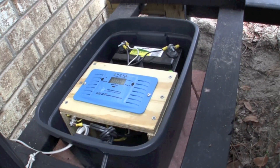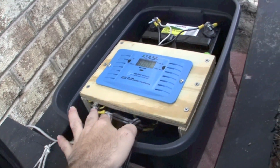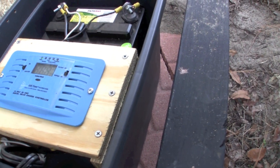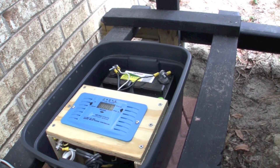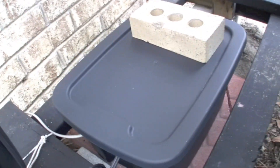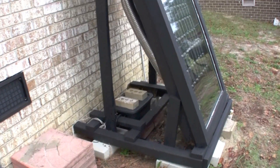Now this is the battery system here, and this is the little thing I built to hold the battery. We have a blocking diode over here to stop it. The system is still charging — actually we're in protection mode, so we're not charging anymore; the system is just basically floating. Just using one little battery to power the fans, and that's it. That's the battery system for the solar heater that actually runs the fans inside. So I don't have to pull any more AC power — using all power off the panels.